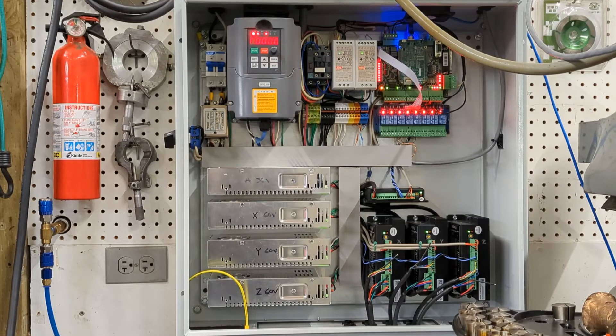In order to convert this machine to closed-loop stepper motors, I went ahead and built a whole new cabinet for it. I only have single-phase power coming into the shop — I have good, clean 220 coming in. However, the 2-horsepower motor on the Bridgeport is three-phase, and to get really accurate speed control I needed the three-phase motor to stay, so I went ahead and installed a VFD — variable frequency drive.